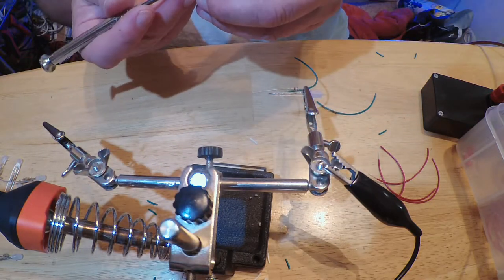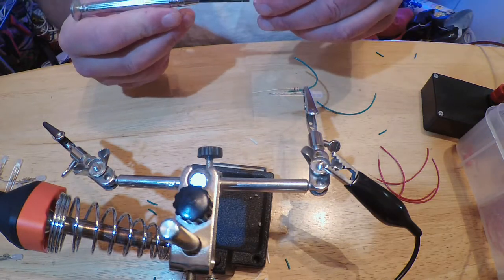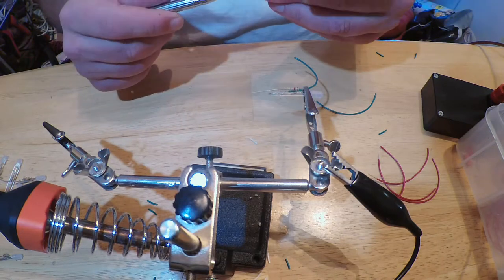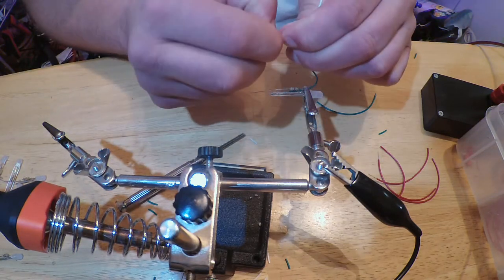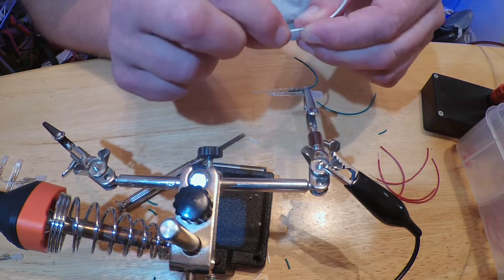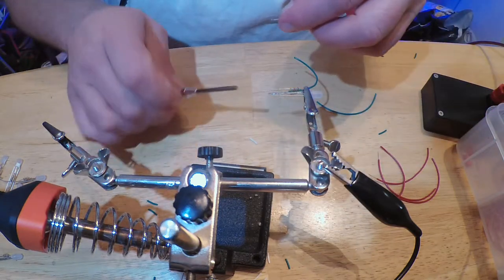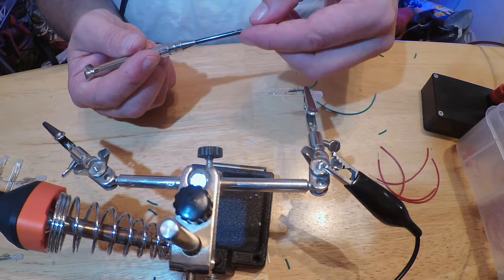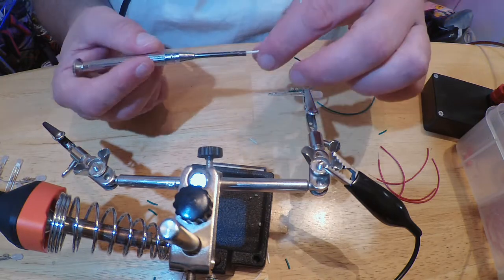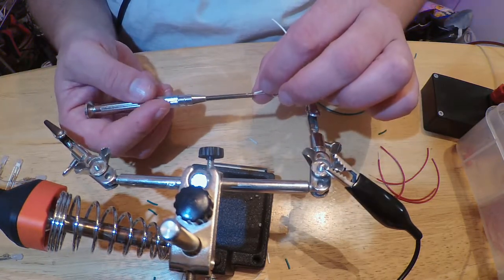And I'm putting the wire in the wrong spot. That's why I'm having a little bit of trouble. I'll start heating up this iron here shortly, as soon as I get this last one wrapped. I got a burr. So when you get a burr with stranded wire, you just basically take your nail and gently rub it out, and then you just take your wire and give it a spin. Now you're probably asking me, why am I using stranded versus a solid lead? Well, stranded to me seems to have more robustness as far as breaking off and stuff.